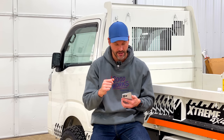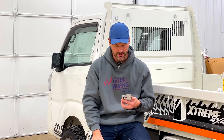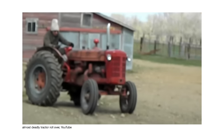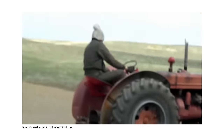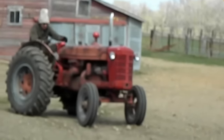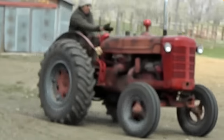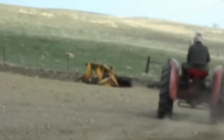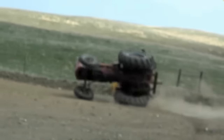This one here is a bit crazy. I don't know if this gentleman was used to using this tractor or not, but he quickly lost control and rolled it right over on him. There's no information on whether or not he was injured. On a gear drive tractor — this is one reason I've talked about before that potentially hydrostatic tractors are safer than gear drive tractors — I believe what happened is that he put it into a higher gear, it took off faster than expected. It appears it had split brakes as well. Maybe they weren't tied together, but I think he only pushed one brake and it locked up one tire. Spun really quick, going at a higher speed. Lost control — he had too many things going on, too many functions — and lost control and spun and flipped this tractor in the blink of an eye. This entire video was 17 seconds long.